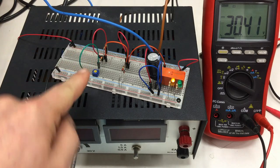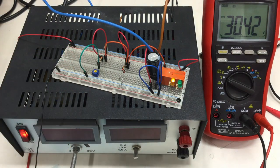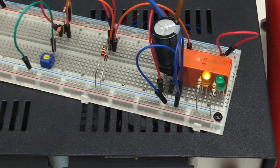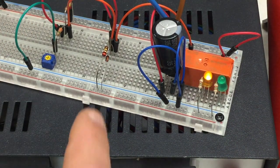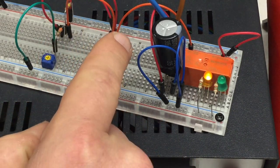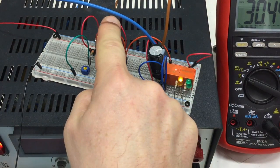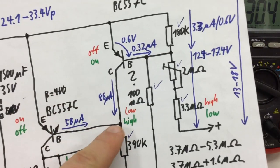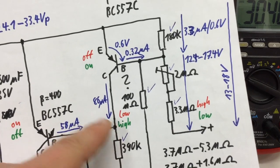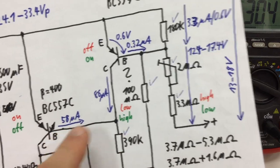So, I put in the second transistor and supporting stuff. Let's zoom in. You can see it behind the cables. But basically, its collector is now going over to the base point. That was the line we manually put high or low when playing with that part,